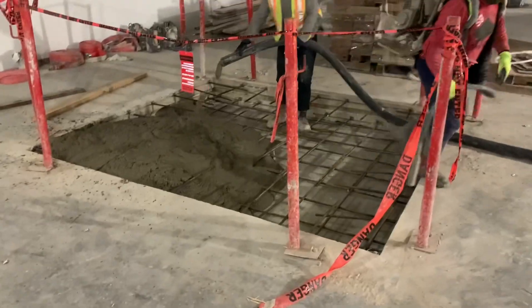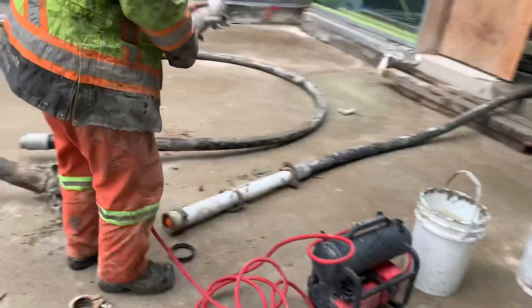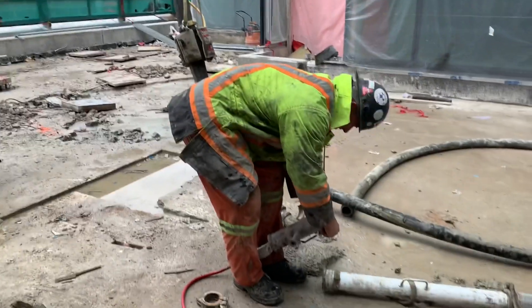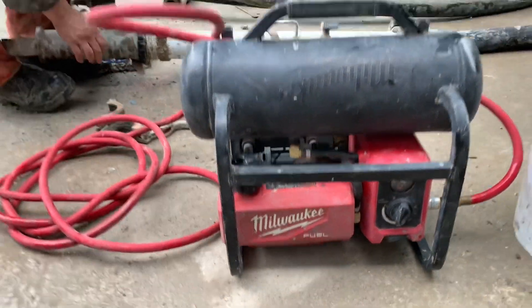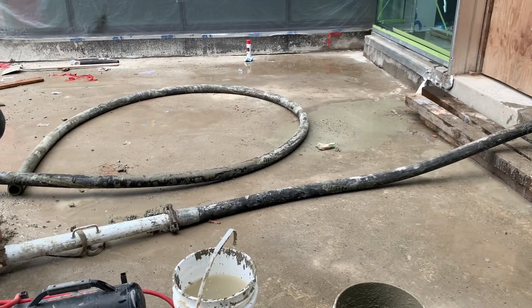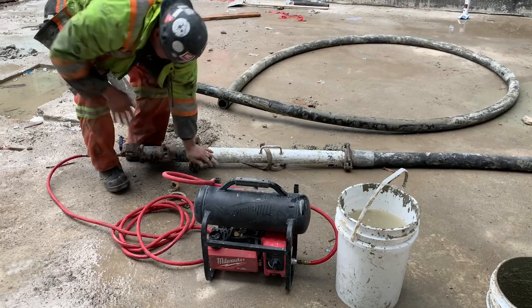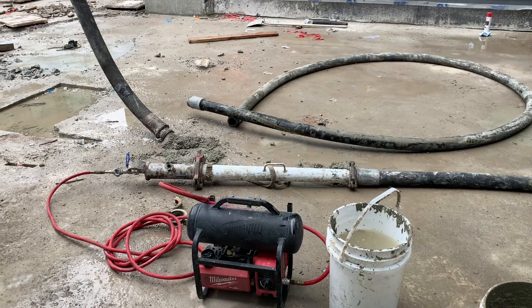You don't want to have a double-ended hose on there for the blowout. So what we're going to do: a soft 3-inch sponge blown through the 2.5-inch line. Little Milwaukee compressor. We'll push it the majority of the way at about 30 psi — just enough to get it moving and keep it moving. I'm going to chase the sponge along, and when we get two to three hoses from the end, we'll cut it back down to about 15 psi. The target is, by the time we get to the last hose, we'll cut it down to maybe 5 to 10 psi and the sponge will just fart out the end of the hose with little to no drama. We've got radio communication and we'll just be in contact.